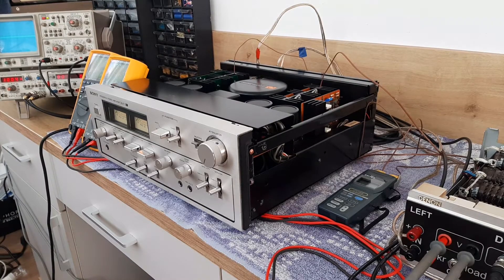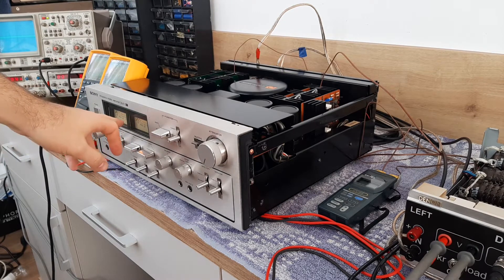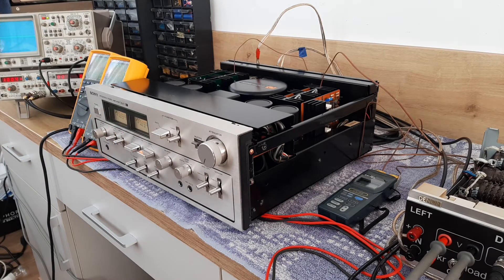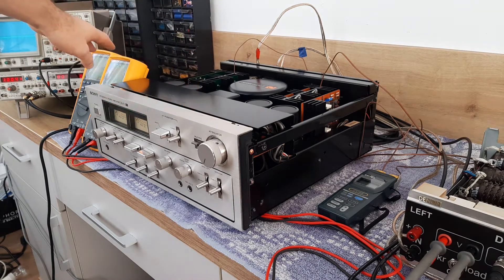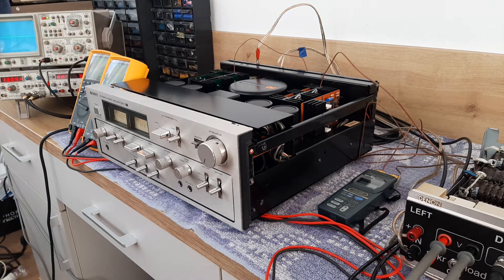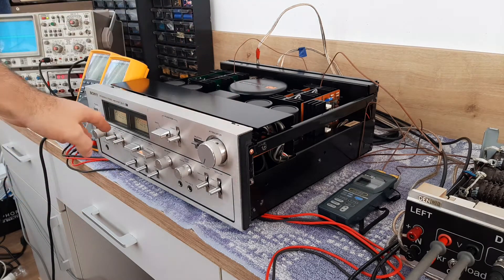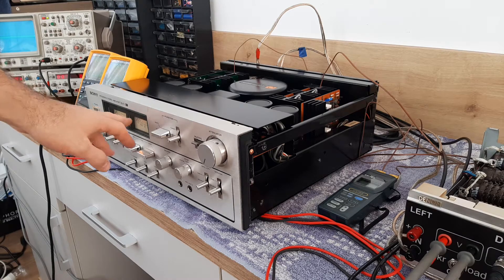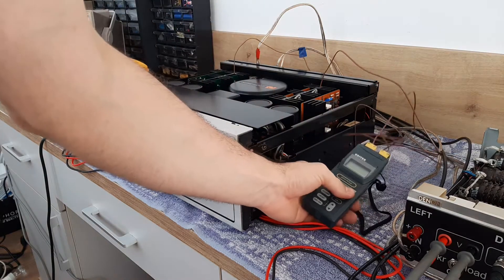In this video we'll discuss adjusting the VU meters according to the designated frequency injected in the power amplifier and according to the readings on the multimeters. We will adjust these two trim pots to match the indication on the VU meters according to the manufacturer manual.